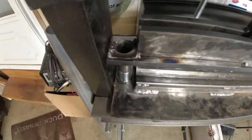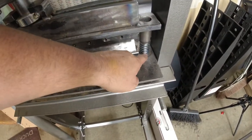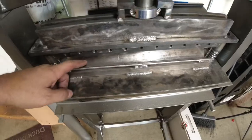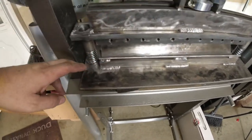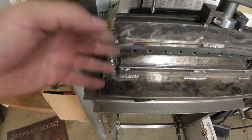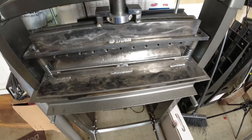We've got a through hole in there, so now I can cut the main pins off. We'll make a longer set, put our bending fingers in here, get this located, and tack these back in place. We'll have a much longer pin, which will allow me to make any length finger in here that I need.